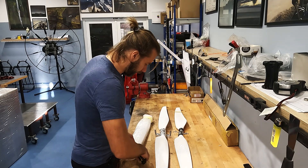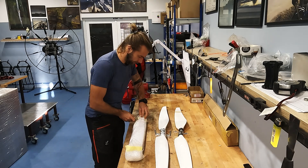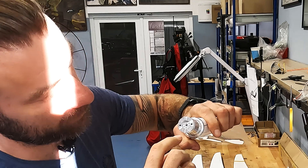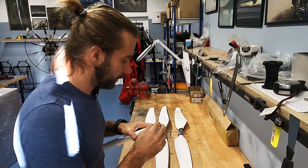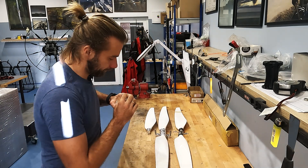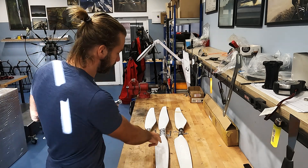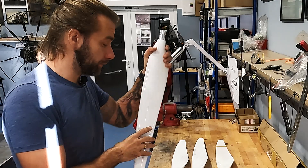The two degrees are a very, very small angle. To explain the difference: these two tiny, very accurate three-millimeter holes are there to install these little levers at a very specific angle. So the only difference between this blade and the other one is that these two holes are two degrees off — and it made a huge difference.